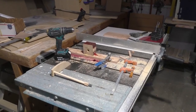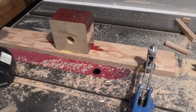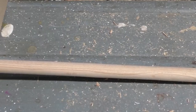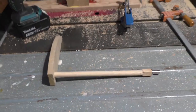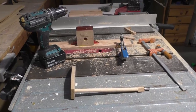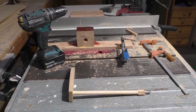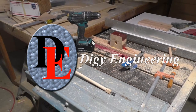So there's how I made my half-inch dowels. To look at the final results of my dowel jig — I've got a longer board I cut, switched to a plywood blade with more teeth for smoother cuts. This is after very rough sanding, and you can see a nice solid fit inside my half-inch hole. Quick, dirty, relatively easy dowel cutting jig — you can make a dowel any size you want. The first time I used one of these I needed a mahogany 3/8 dowel, which you can't buy anywhere, and without a lathe it's pretty much impossible — and I used one of these just like this. Be sure to subscribe and hit the notification bell to be informed of future updates.